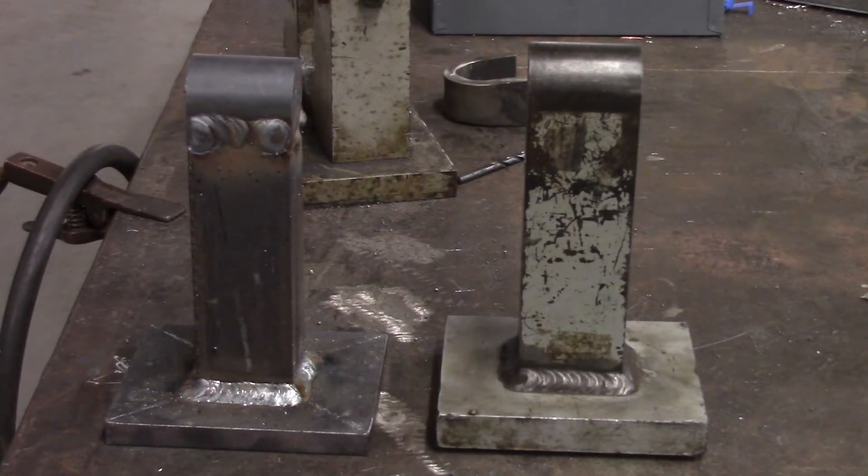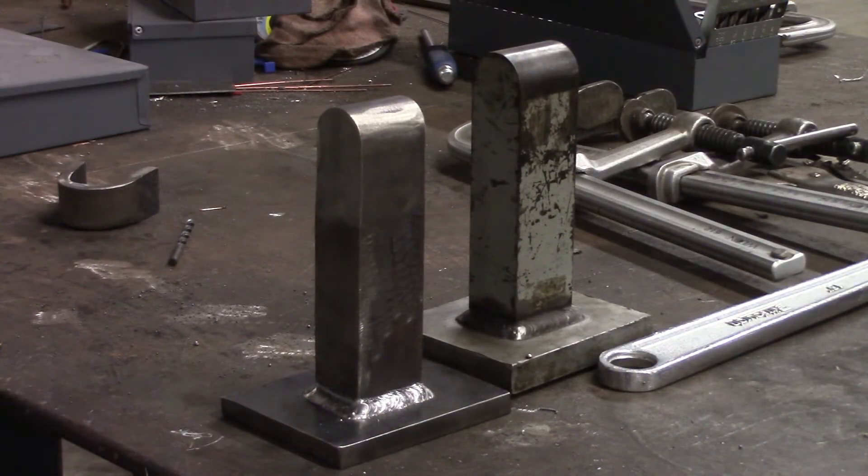This is the plunger we just got done welding up — it looks pretty close to the original. The only difference is we didn't use as thick a plate on the back side, because we don't need it; we're putting it into a hydraulic press anyway. I'll grind it up a little bit and then we'll move on to the other part of the jig. Now we're going to draw the other part in AutoCAD and cut out layers of half-inch plate to make the correct thickness for the other section.